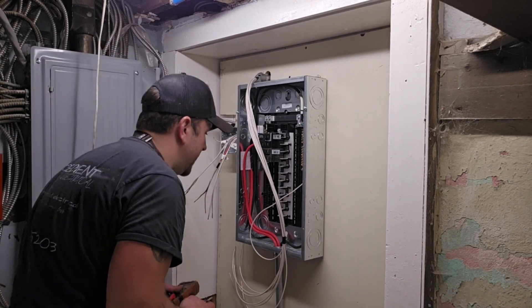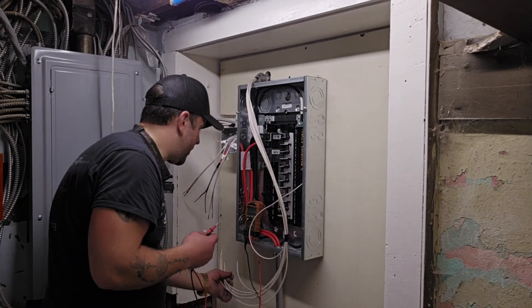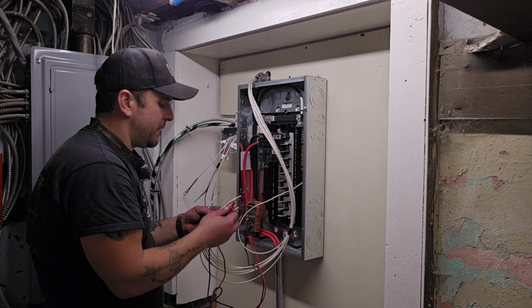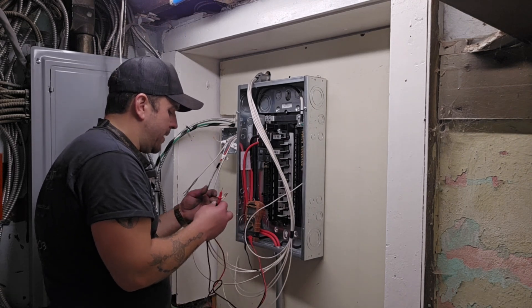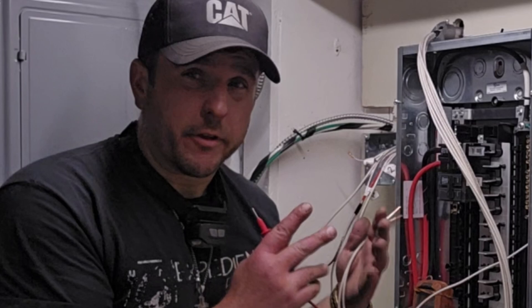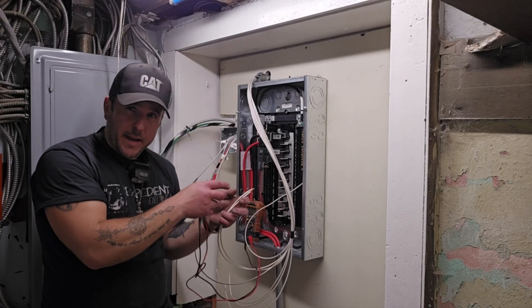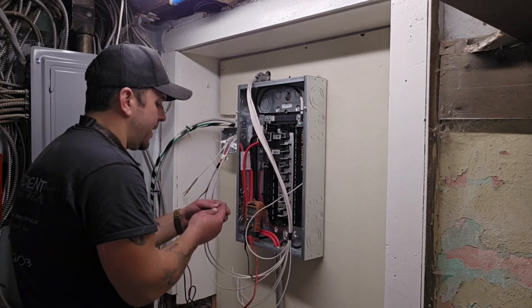Audible continuity — touching my leads just to make sure. Sometimes these loosen up, so you've got to always test your multimeter by touching your leads together before you start checking wires. Now we've got the other two wires connected on the other side — remember I put the wire nut and connected the two stripped wires together. We're going to find which ones those are.